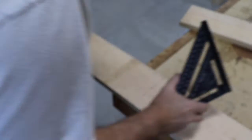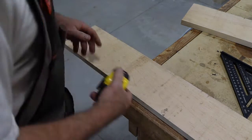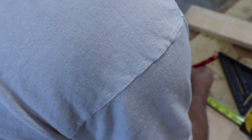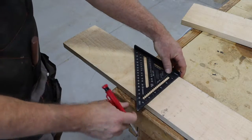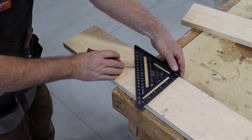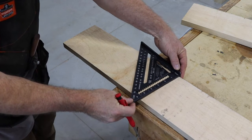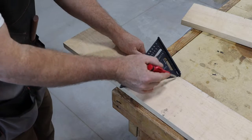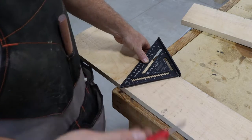The next cut is an angle cut called a miter cut — you're not going to cut 90 degrees; you're going to angle it. First, measure 15 inches and put a mark on the edge of the board. Place your square on the mark, then find the 30-degree line on the long edge of the square. Keep the pivot point on your mark and move the square until the 30-degree line reaches the edge of the board on the other side. Mark that line and cut it.